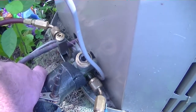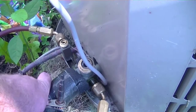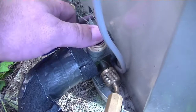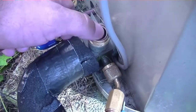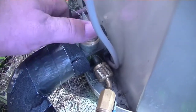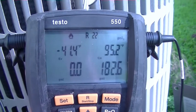I'll probably leave it for a while, even a day or two. I'll watch it to see if I see an immediate drop, but if not we'll just leave it. Well guys, it didn't get very far — that seems like a pretty bad leak to me. I noticed some discoloration on it when I opened it up; I didn't know it was going to be that bad. It might not be as bad when it's open, but it's hard to test it with it open. I'd say that service valve leaks pretty badly and we're already down to zero.